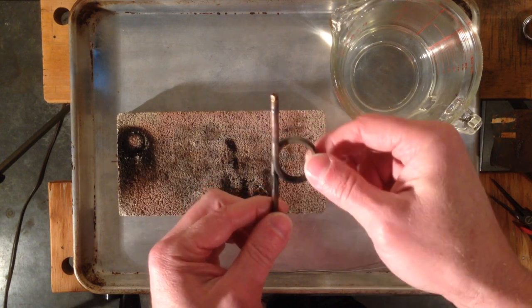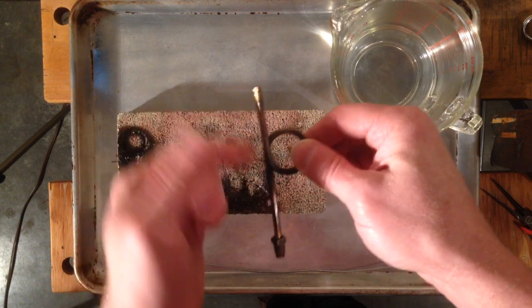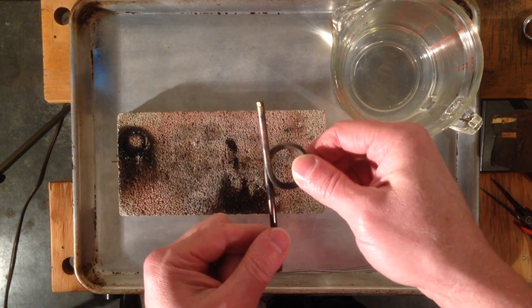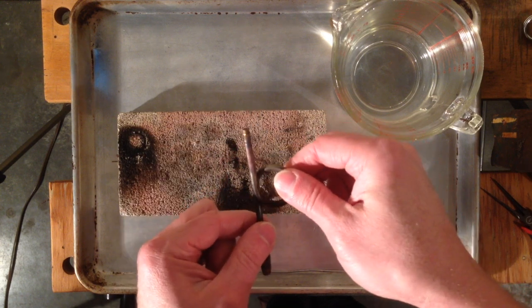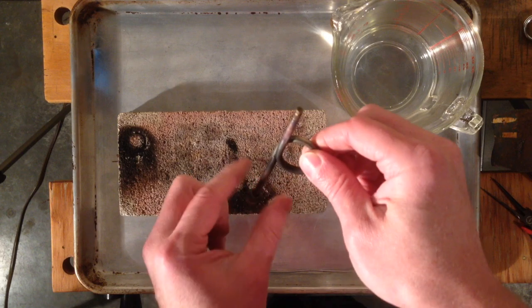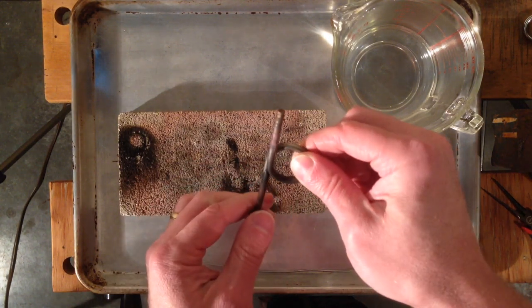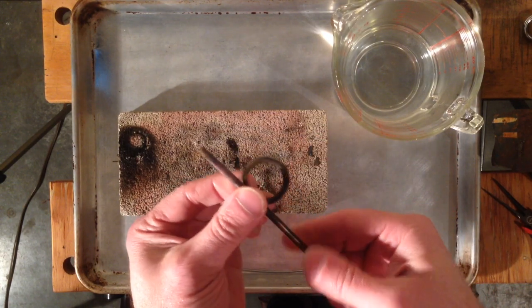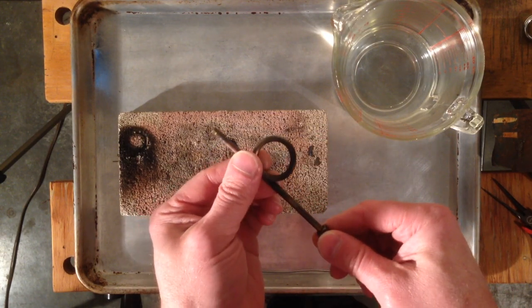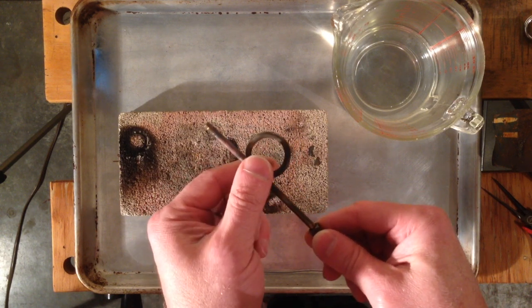They light up beautifully, but because there's a loop, there's no cleaning rod or cleaning pricker. So the disadvantage with these is if they do throw a bit of carbon or clog up in the tip, you've got to turn the lantern off, let it cool down, unscrew this, take it out, and use a cleaning tool with a needle to poke it from the outside. These work beautifully — when installed, the lanterns sip fuel and put out a nice steady light, but there is no way to clean them.